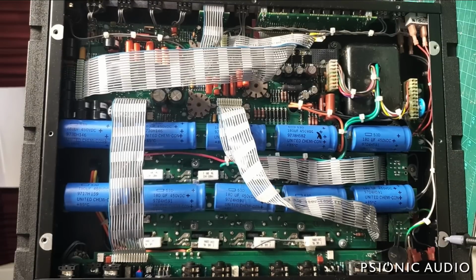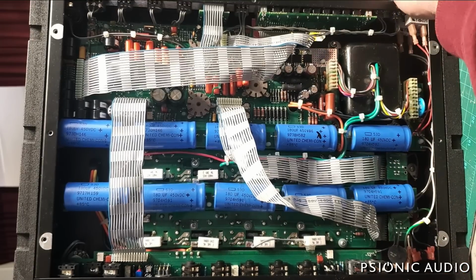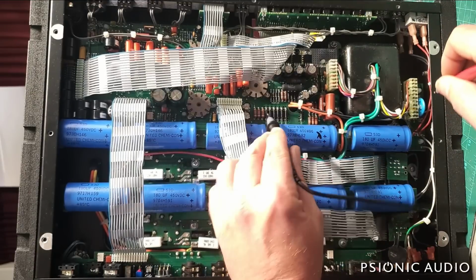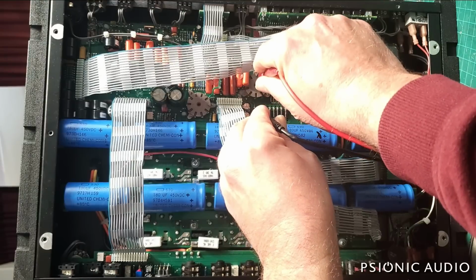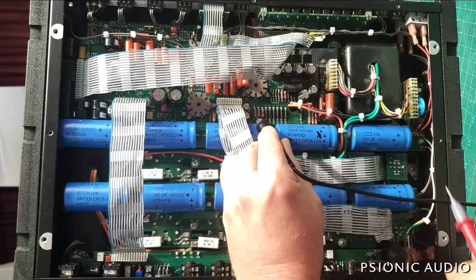The node which is supplying V2's plates, V3's plates, and the B plus going to the IRF 820s. So if that one resistor is the fault, that would be nice to know. So let me go to ohms, make sure this thing is powered off. All right, so one end of potential R106 and pin 150, oops, that's why I have it powered off.